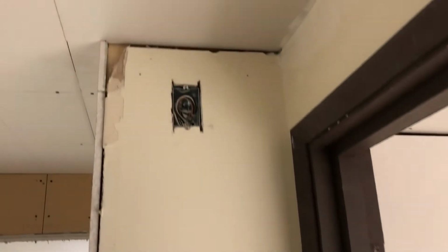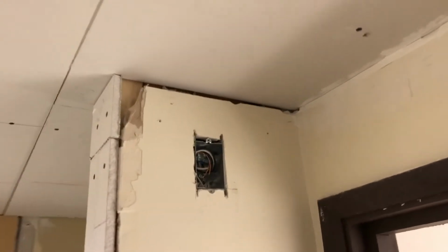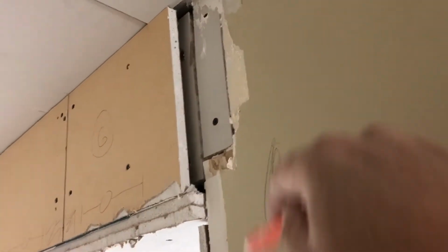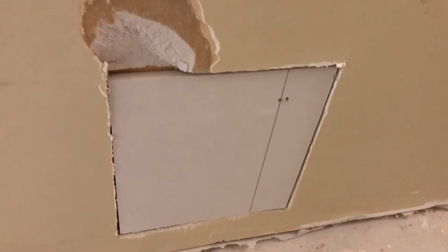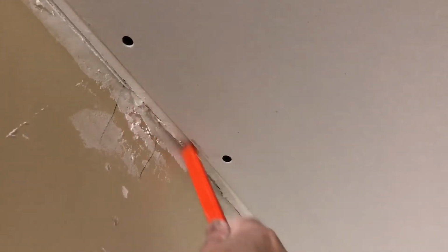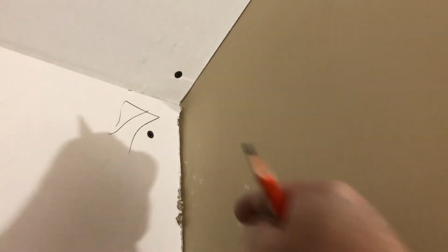I always pay extra attention to the joints because I really cannot afford the joints to crack. The matter of fact is that if I use paper tape, it cracks. People think that's normal. You know, I'm doing tapeless drywall finishing. If it cracks, people would consider the reason to cause the crack was I didn't use tape, so I don't want that to happen. So you see this gap is pretty big, like 1/2 inch, and those damaged areas got to be fixed.